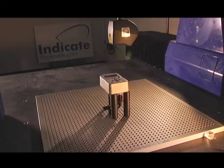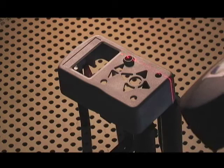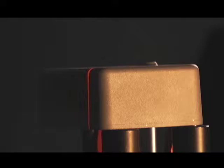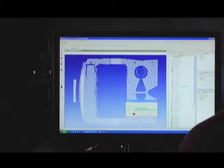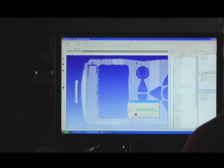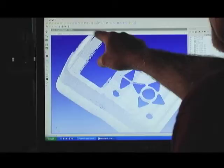What we're doing right now is there are going to be three different scans — one will be the top view and then two side view scans. It'll go in multiple different sections across the part with a bit of overlap, to make sure there's no missing data. It can scan fairly quickly; it's all dependent upon what spacing you want the stripes to be set at. Right now it's set at 30 micron spacing between the stripes, moving step by step right across these tabs.